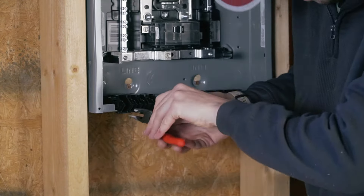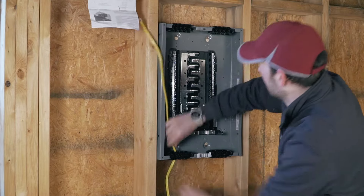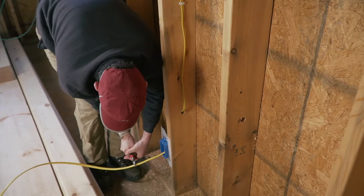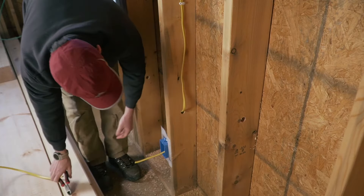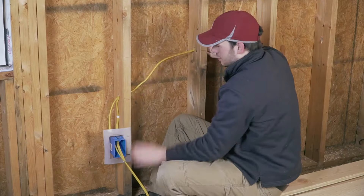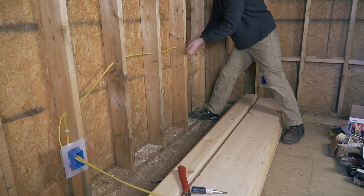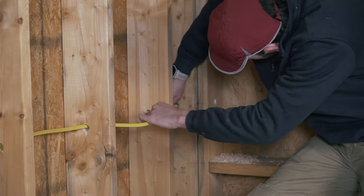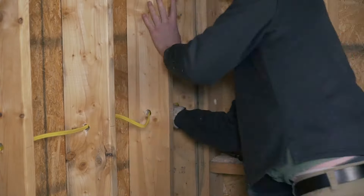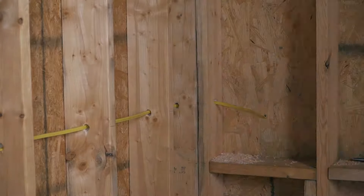You'll need to make a hole in the plastic cover, poke a tab off, and then feed the wire through that hole into the wall. There'll also be tabs to remove on the electrical panel so you can fit the wire directly into a slot. Per code, you have to staple those wires into place — pretty close to the electrical panel and also right next to each box where the wire enters.